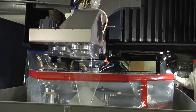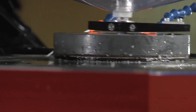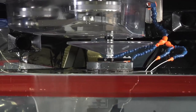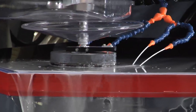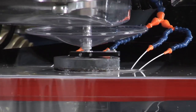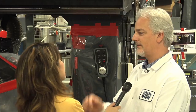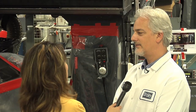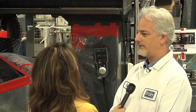Beryllium is a very difficult metal to polish. The process is a bit like exfoliating skin — trying to get rid of that top layer to reveal a brighter surface underneath. The mirror surface has a texture of little peaks, and this process saws them off until you have a perfect plane. These are not flat mirrors, but you want the surface to be very continuous. If it has roughness, each little lump and bump reflects light in a different direction and it doesn't come back to the detectors. This process makes the surface extremely uniform so you have the maximum amount of surface area returning light.